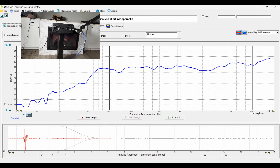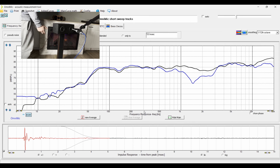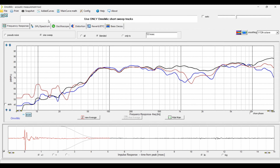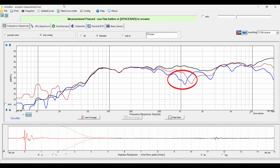Let's take a look at the Dayton Audio first — its on-axis response. What I want to find out is how it does off-axis. As we turn it to 30 degrees, we're going to see some major issues around 1.3 to 1.5 kilohertz — it's 15 decibels down. You're going to have real trouble hearing that frequency range, really everything from 1 kilohertz up to 2,500 hertz. At 45 degrees it's even worse. The issue at 1.5kHz shifts to 1.2kHz and there's another issue at around 2,300 hertz. Everything from 1 kilohertz to 2,500 hertz is having major destructive waves, which is a huge issue because that range contains a lot of detail in movies. Now let's take a look at the Rule Breaker.